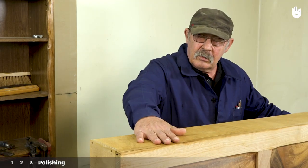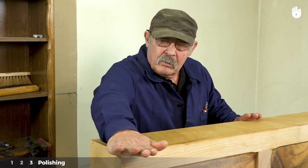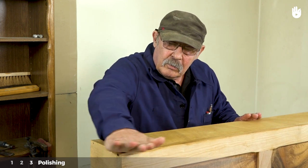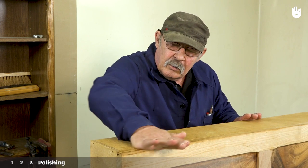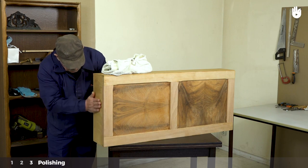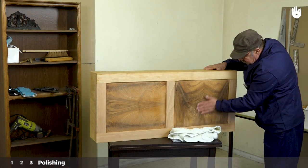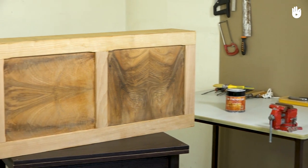You've finished polishing an area when it is no longer sticky to the touch. For an even better shine, make small rounded movements with your bare palm over the parts which are still sticky. Use this technique systematically over each area of the piece. You now know how to wax furniture with a brush.